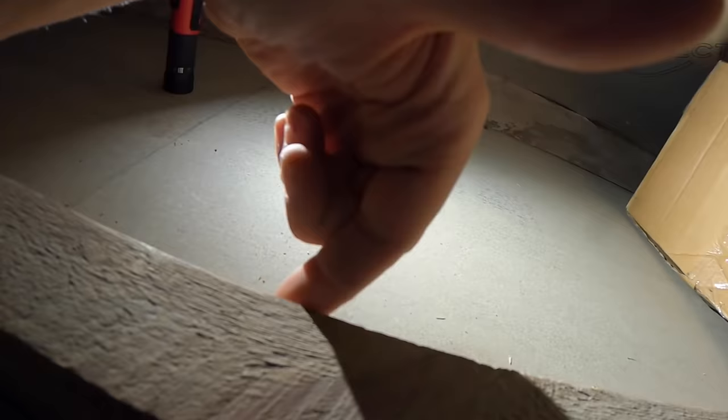The client can then build over the top if they want, but I'll suggest not to, because you're gonna have the cable hanging out here. What I'm gonna have to do is, I can't fish through any of this because we've got beams everywhere. This is the beauty of an old house. We'll have to come along, clip along the edge of here, and then run along to the next light. This one isn't so bad because there's three in a row.